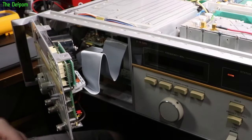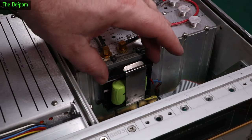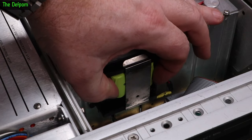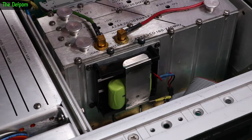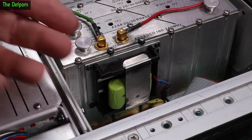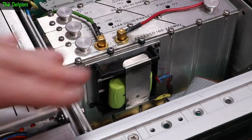I've now sorted the battery pack. I've taken it all out, removed all the corrosion, and I'm not going to use the original holder because you can't get replacement battery packs for these anymore — they're a unique style. I've got a standard 3-cell nickel metal hydride battery. It's a bit smaller than I'd like, but it will do the job. I've wired it onto the original posts with extended wires and a little header pin connector — that runs down to the original posts on the circuit board, so it just plugs in. When it needs to be changed you unplug this and plug the new one in. Nice and easy.